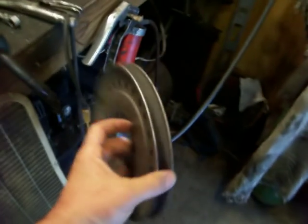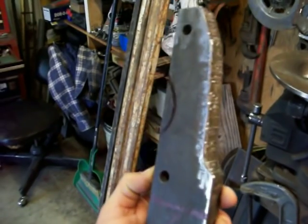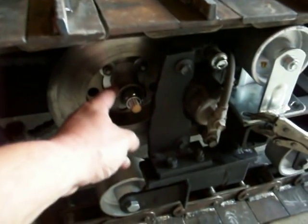Here's my big pulley to reduce the speed down further. Here's the one-inch adapter. New rotor, another new rotor. There's the brake caliper from the '03 Impala with new pads on it. Here is the disc bracket that I got started making a few days ago as I was making the other side — got a little more trim work on it. There's the other big sprocket for the left rear. And all I need then is a piece of chain and the minibike bearing assembly that we used to turn the rotor with. That's what will be needed there.